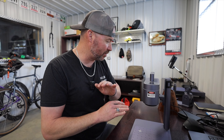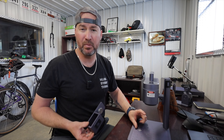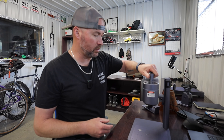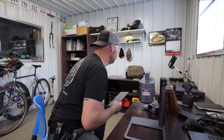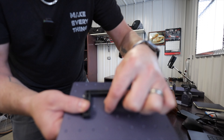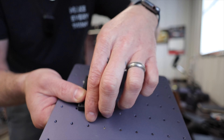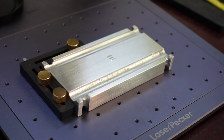To focus this, there are two buttons on top to move the head up and down, and two little blue lights that come together when you're at the correct focal distance — it makes it super easy. They also have a riser for thicker materials; you could probably engrave something up to about four inches thick. There's a little plate that pops out with a tapped grid, and they give you angle stops and screws so you can set exact positions and batch out projects quickly.